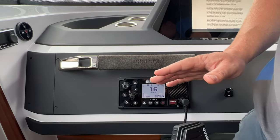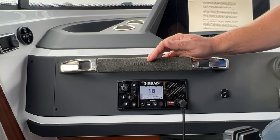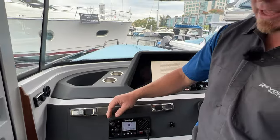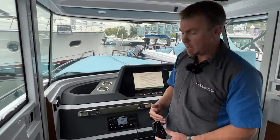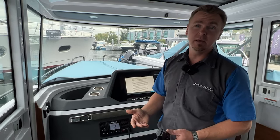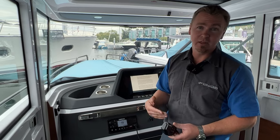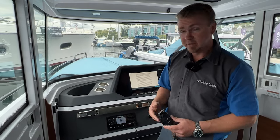Okay, so let it settle there for a bit. And if you find that static keeps coming in and out again after you've made that setting, then you can do that again and just go one more level up. But never go any higher with your Squelch than what you need to be. It's simply to cut out the background noise, right? That you don't want to hear when you're driving around. Okay, so that's how that works.